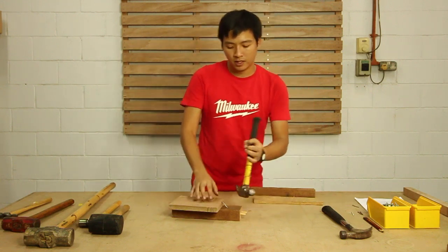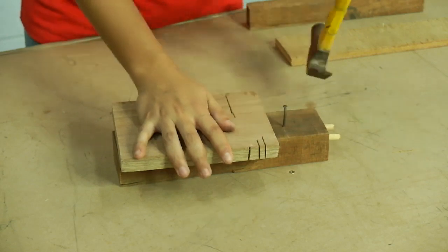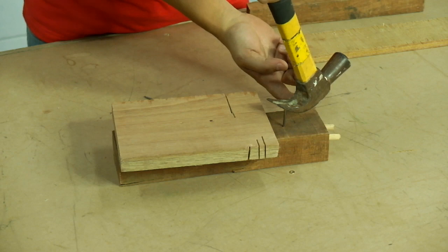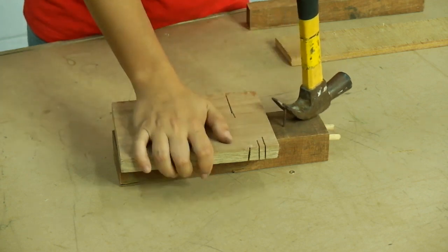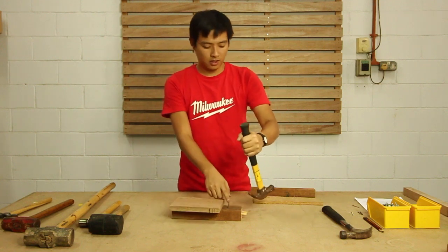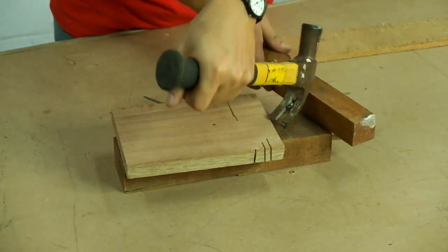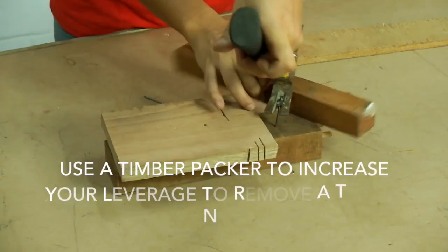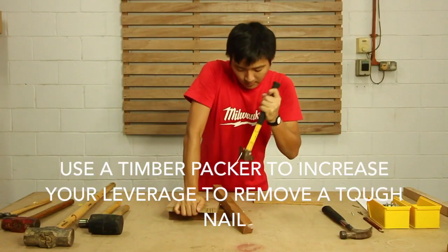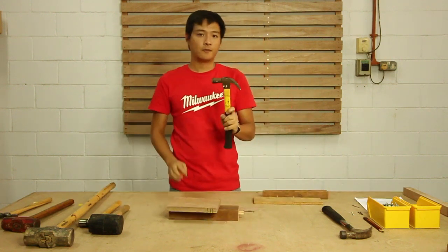So how to remove this is to use the back side of the claw. Hook it to the nail, then turn it up, and try removing it with the head resting on the wood. It's quite difficult to pull in this way, so you use a timber packer to put at the back of the hammer — you get more leverage pulling the nail out. That's how you can pull out a nail easily with the claw hammer.